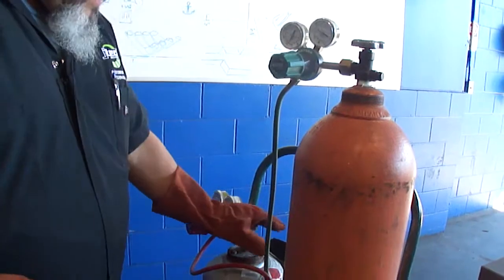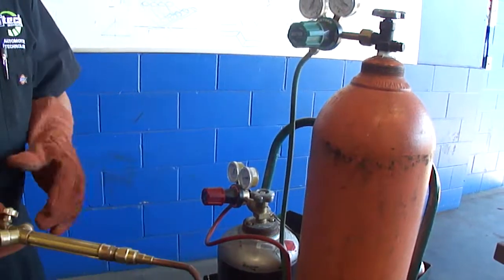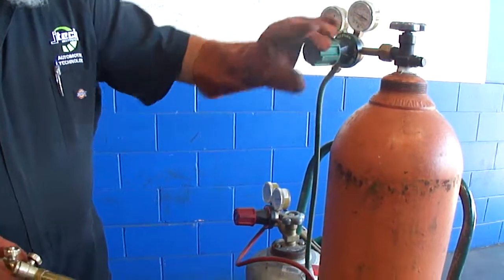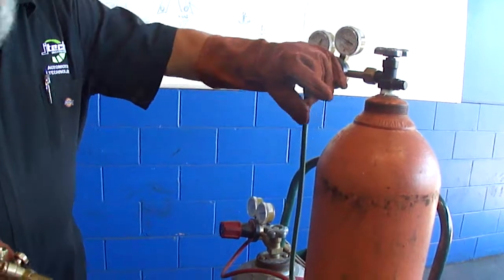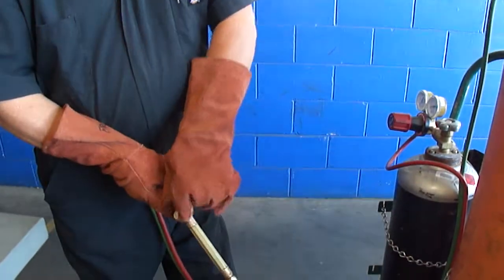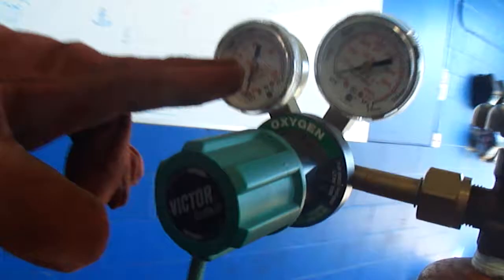I've closed down my oxygen, closed my acetylene, and I'm going to add a little bit of pressure here with my oxygen, and then I'm going to open the oxygen and vent it until I get zeros. I don't want anything in there.